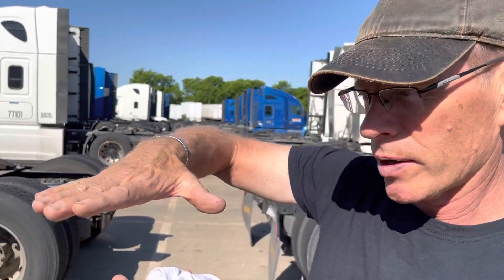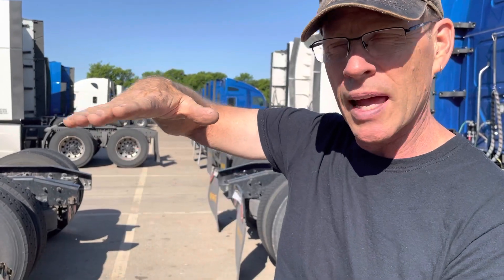Any other things somebody should keep in mind when doing that? Just be thorough, spread it around good. If you get the chance, clean it every now and then — take a scraper and scrape off all the sand and dirt that's trapped in the grease, because you don't want that grinding away at your fifth wheel. The trailer apron is the part underneath the trailer where the kingpin is hanging down — it's a good idea to look at that too, to make sure it's clean and properly lubricated. Give us a thumbs up if you learned something, put comments and questions below, and please subscribe to the Joy of Trucking. Off to Iowa today — with love from Kevin and Tanya, bye!